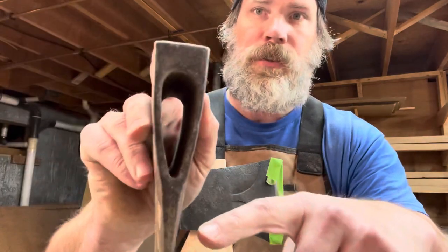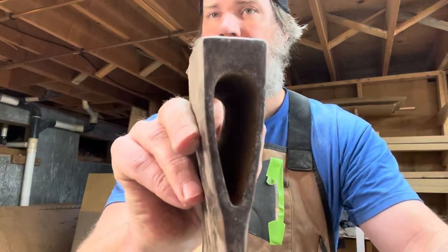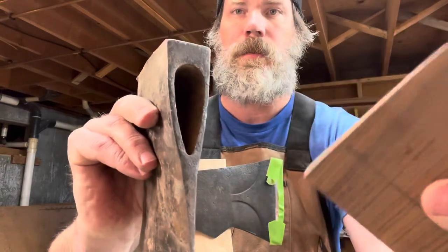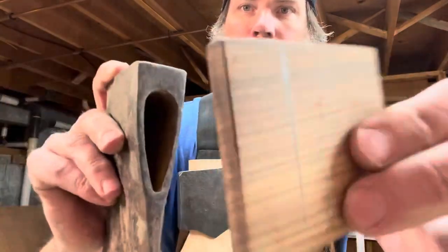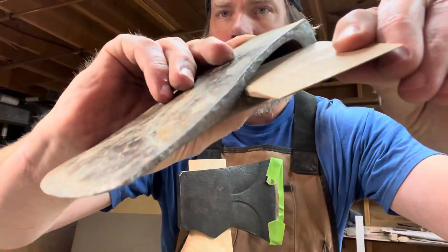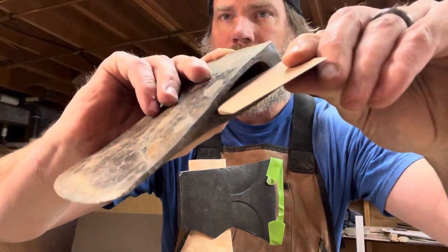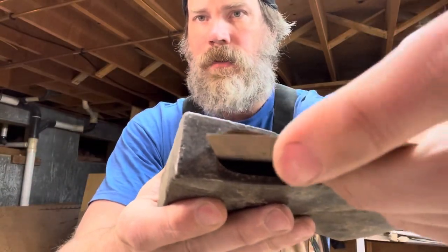I haven't had great outcomes all the time with a square wedge. So what you'll notice is on the eye of an axe, you've got a nice little rounded kind of beady section and then a smooth little section in the back. My technique for testing the shape — and this is an eye that's similar to the one here — I'll actually put it upside down and kind of start creeping up and see how far I'm getting that wedge driven and see where the snug and the fit is. I'll do that to both sides to make sure I got that curve of the shape just right.